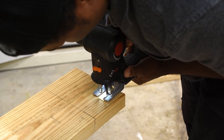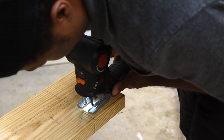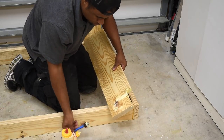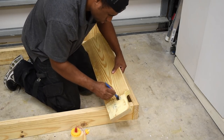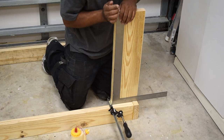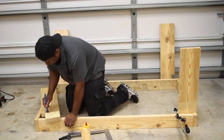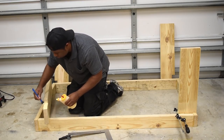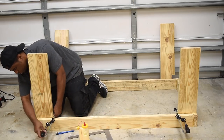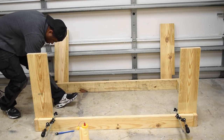I'm using a jigsaw for this, but you can also use a bandsaw or a handsaw to cut this out. Now this is southern yellow pine, so there is a bit of warp to some of the lumber and they're not fully straight. So I don't exactly know where I'm going to get glue coverage by the time I'm done fixing things in place, so we're just going to flood the entire area with glue. My floor is not straight because of the pitch and other variation in the environment, so I have to reference off the apron frame. I know I'm not going to get perfection using rough lumber, but I'm going to darn sure try.